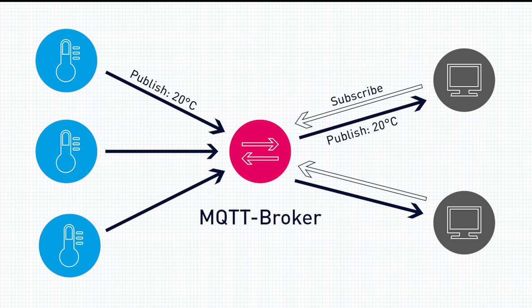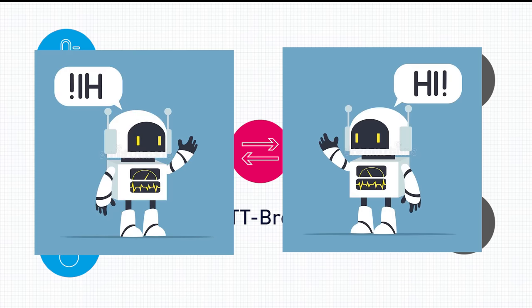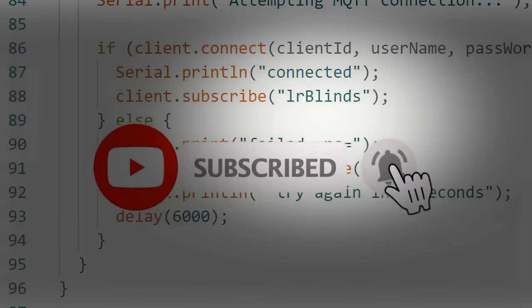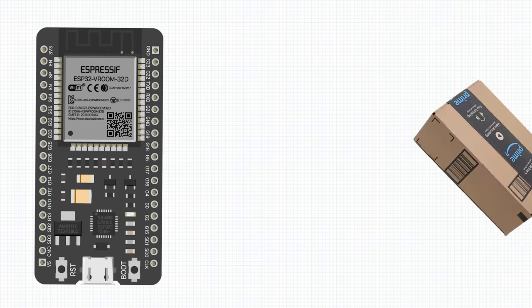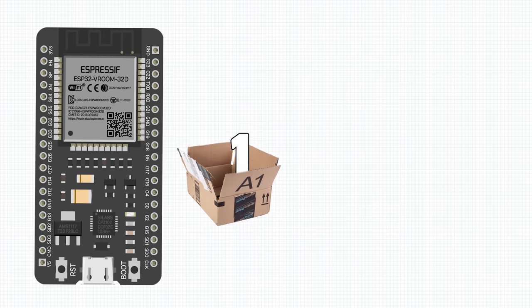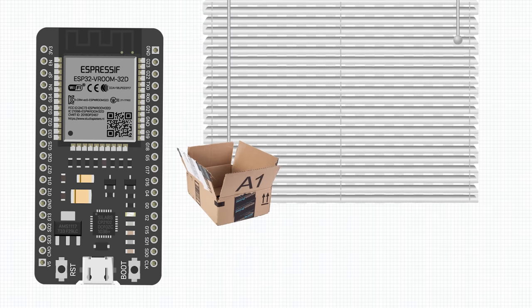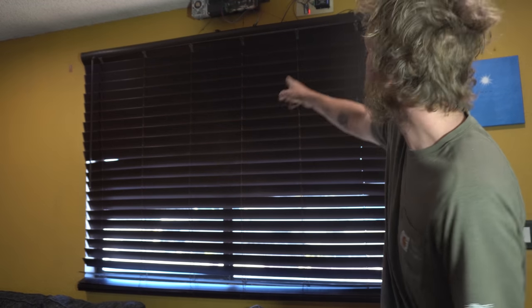MQTT is a messaging protocol used for machine-to-machine communication. We subscribe the ESP32 to the topic of LR blinds and send it packets from Home Assistant. When it receives a 1, the blinds go down for a set amount of steps. When it receives a 2, the blinds go up until they hit the home switch. For all intents and purposes, it's done.